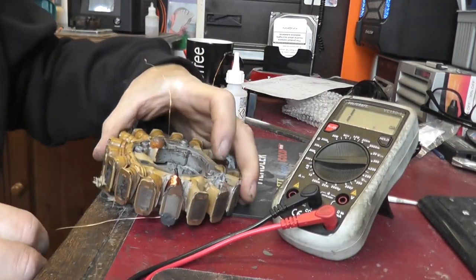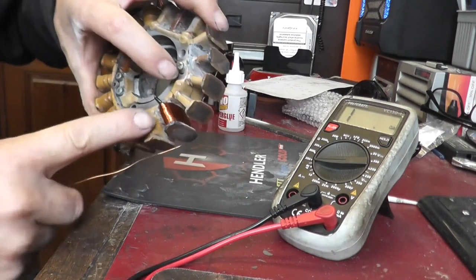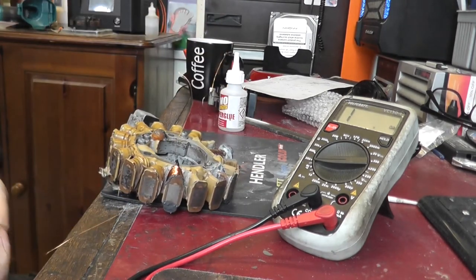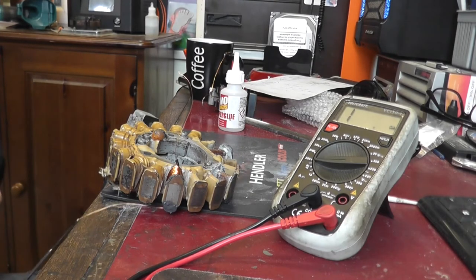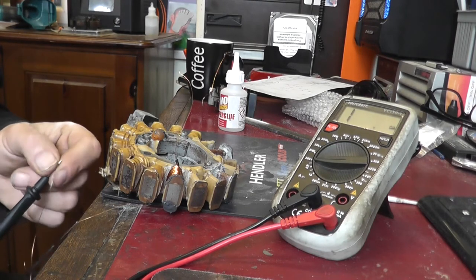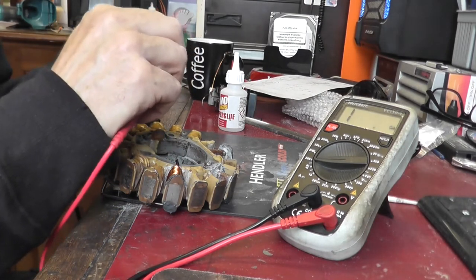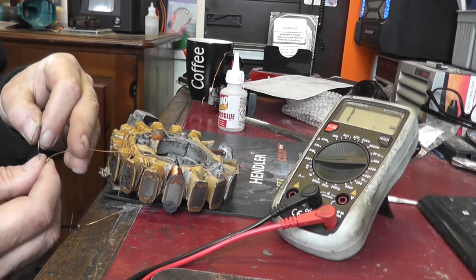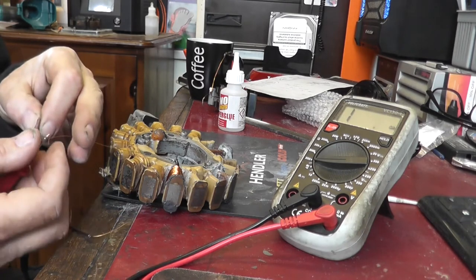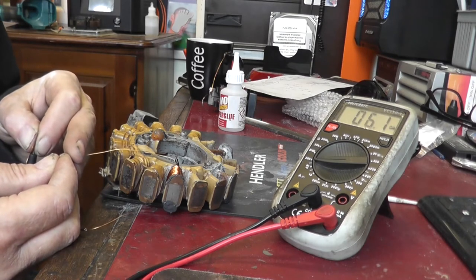Pull that through and then basically just wind it around, getting the layers as even as you possibly can, minimizing the overlap. So we bring the wire on there and on that core, layered it as best we can. Now we need to do an ohms check on it and make sure it's about right — clean up the enamel covering on it. There we go — five point nine ohms, about right, six ohms. Depending on the temperature, quite warm in here, so it will be a little bit higher.